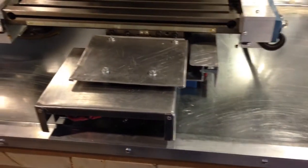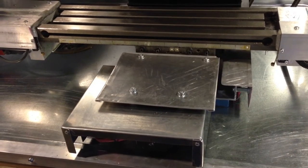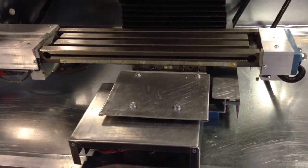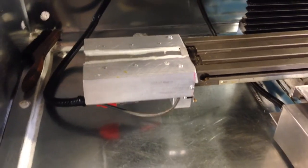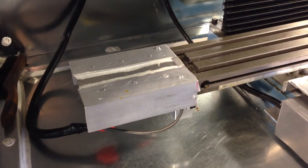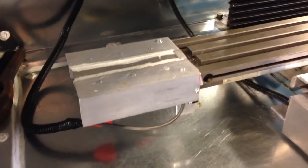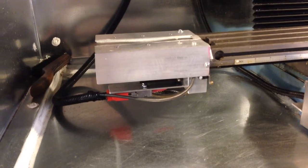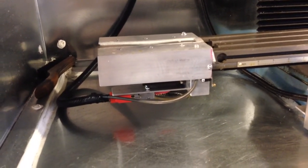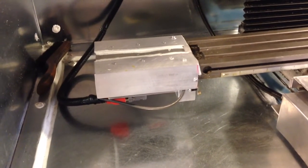The second one is this flat aluminum panel on the Y-axis, which moves back and forth with the Y-axis to cover the ball screw and other components. The accordion rubber covers that came on the mill kept getting bunched up in this particular place. Over here on the X-axis motor, it's a slightly different configuration — really just because of the materials we had on hand. A couple of pieces of angle aluminum with a little piece of sheet aluminum between them make a nice cover for the X-axis. The 9-pin D connector is spaced on a little aluminum bar to keep it away from the main work area.